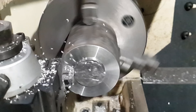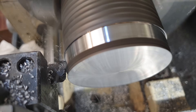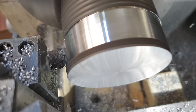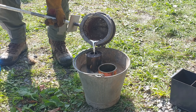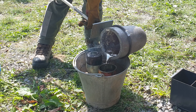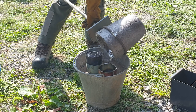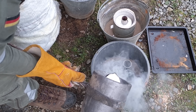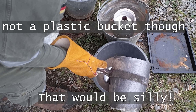Let's start on a random note: stop making muffins. Assuming you ever want to make any actual parts, you might as well start playing around with sand moulds right away. If you have a lathe, or there might be one somewhere in your future, you have a supply of free easy aluminium bar stock. Instead of pouring leftovers into a muffin tin, use bean cans, old paint tins, or industrial grade peanut butter containers like I am here. Pop them in a bucket of sand and fill away as smoothly as possible. It seems like a more useful use of spare material and you can always re-melt it back down.